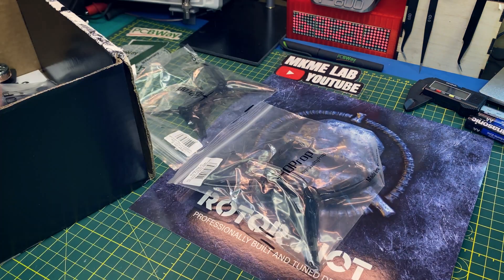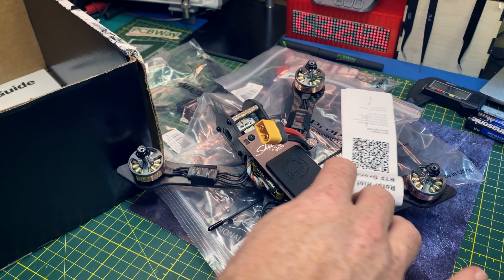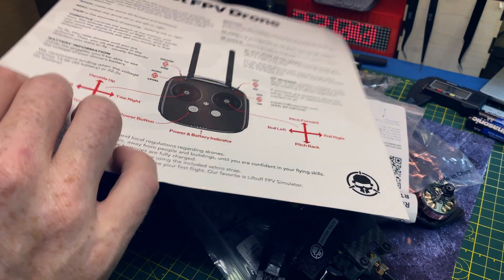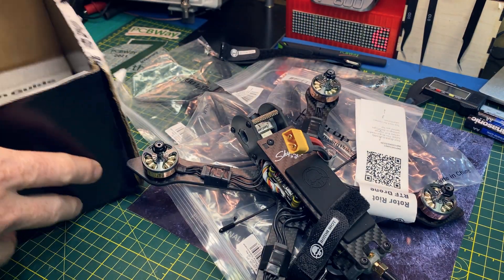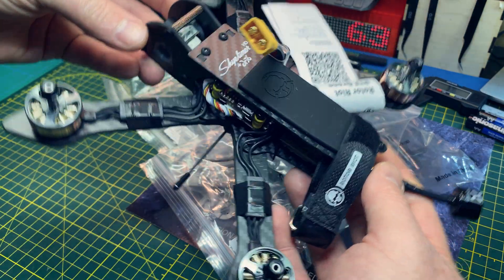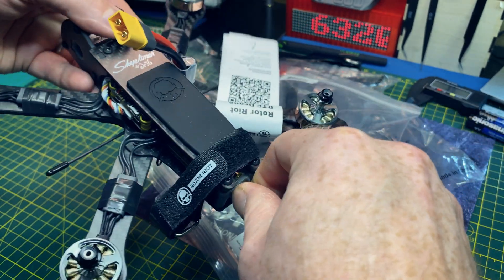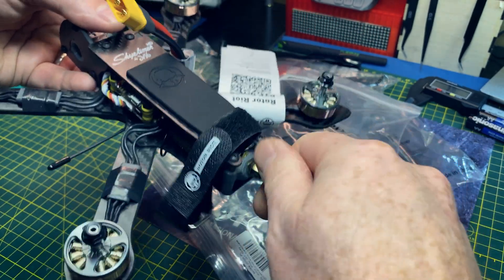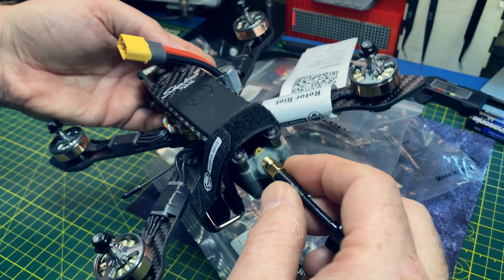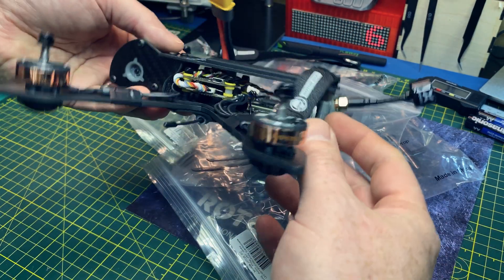Finally going to have a quad that's not made of cheap eBay junk. We have the real deal — right from Rotor Riot, comes with an installation guide for the props. Really basic stuff, but this is the Skyliner Dribbs frame and it looks awesome. I am excited to try this out. Wait — that is not off to a good start. It's tight, but the coax is still spinning inside the nut. I'm assuming their 3D-printed bracket is holding back the nut from tightening all the way. I'm going to have to fix that. I hope they didn't run it like that very long — that will toast the VTX in a heartbeat.